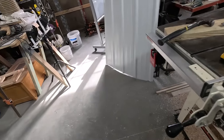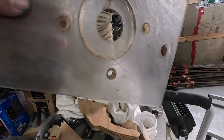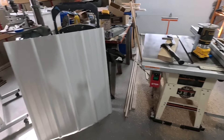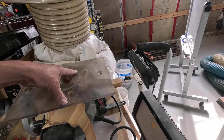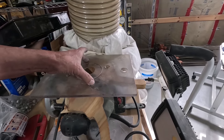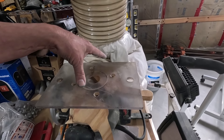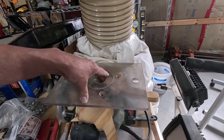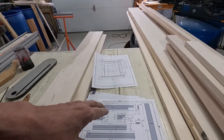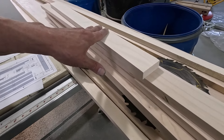I'm gonna need to do some kind of a setup. This has seen some use over the years — I probably used this for 10 years. This was an insert into the wing of my saw, and I'm gonna have to figure out a way to clamp this down. These holes are for mounting the router, so I'll mount this to something where I can get it on and off to change the bit, and with any luck we'll get the rest of this molding done today.